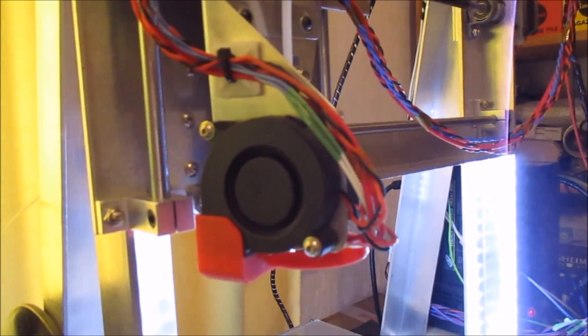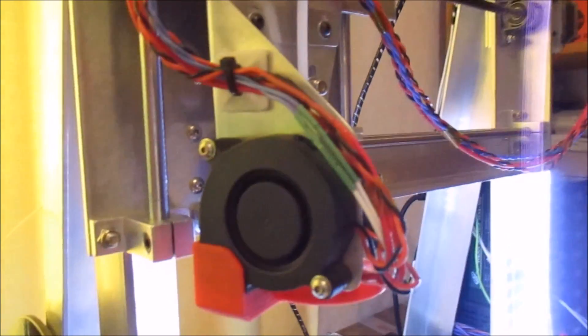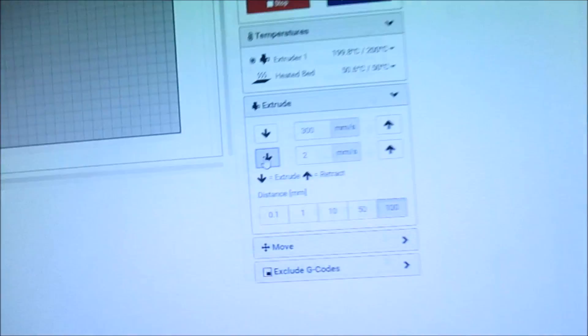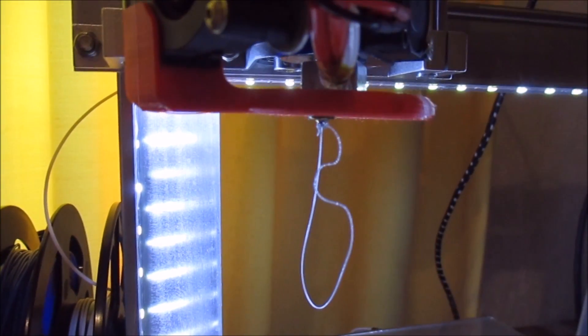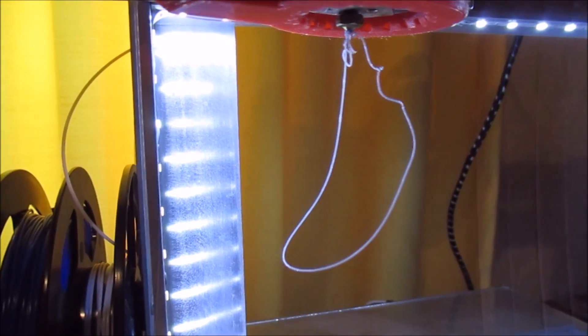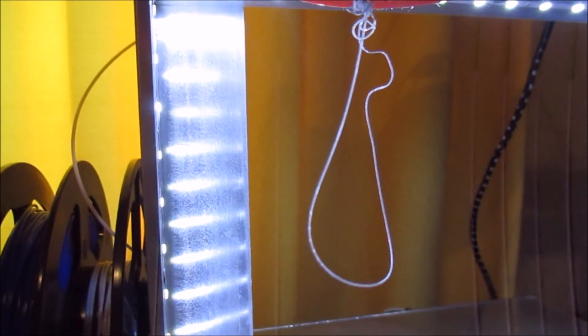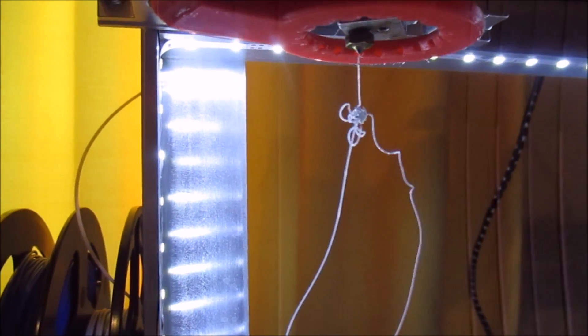The design for the lubricator is a thing on Thingiverse - there are all sorts of different kinds but it works very well. I've got the white filament spooled up, manually pushed it down, and now I'm feeding it through using slow speed - a few hundred millimeters - just to clear out the nozzle. White is a bit of an annoying color because you have to extrude quite a bit to make sure the previous color is completely cleared out.